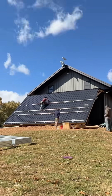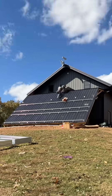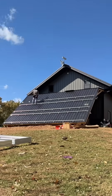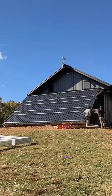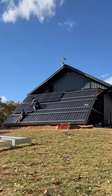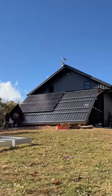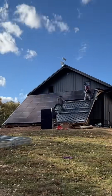Unlike the panels on the garage roof, this is a more optimal angle for wintertime sunshine, which is the only time I really care about power. The idea is that this array will do the bulk of the charging. This array is facing southeast to catch the morning, and the other array is southwest. My old panels were just facing south. Sometimes it would be cloudy in the middle of the day, and I would really miss the power coming in from the morning or evening sunshine.